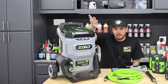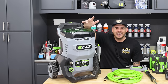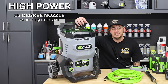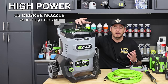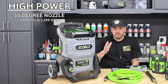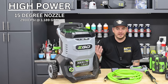Moving into the high setting - this is where you'd expect the rated 3200 PSI, which is a very lofty number for an electric pressure washer, let alone a battery-powered system. Right when I pulled the trigger I got 2800 PSI. As I was doing my GPM test, watching the gauge, it crept up and hit 2900 PSI. Over time that may increase even more once everything breaks in. Are you going to get 3200? I don't know, but that's within a small margin of error. We'll call it 2900 PSI, and at those numbers we were getting 1.189 GPM - just under 1.2. Their 3200 PSI, 1.2 GPM rating is accurate; those numbers are so close you can't fault them.